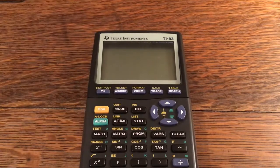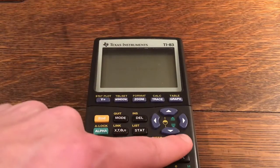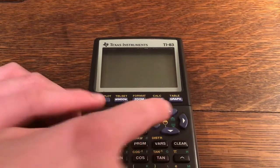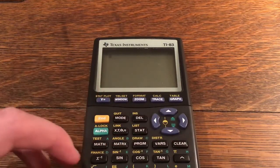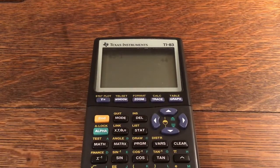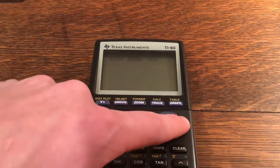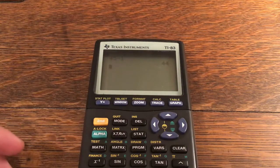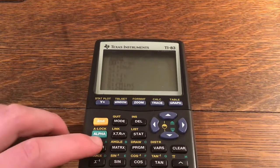Here's the first time I'm going to attempt turning the calculator on — hopefully we have fixed it, so let's find out. It's very faint, but it does say memory cleared — that is a good sign. I click the clear button and it did not crash. I'm going to click second and up to bring up the brightness, and so far it has not crashed. Going into mode — looks like everything is working so far. 45 minus 1 equals 44 — the calculator is working, which is awesome. I'll click program. There's nothing in it because the calculator is cleared when you take that coin button battery out — that's how it keeps its memory. So if you do change the batteries, keep that coin button battery in there if you want to keep the calculator's memory.